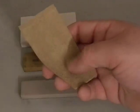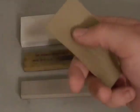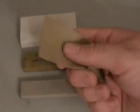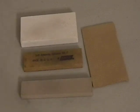Lastly, the strop. I start on the suede side, give it maybe 20-30 strokes, go over to the smooth side, 20-30 strokes, and then usually what I will do is finish the strop on my pants, usually like I'm wearing cotton poly pants, and those will actually give a fairly good final strop as well. So at that point, usually the knives are very sharp. They'll take hair off your arm, very, very sharp.